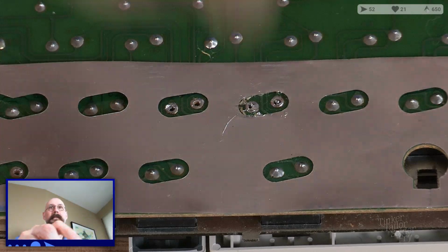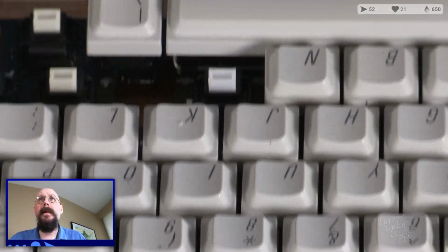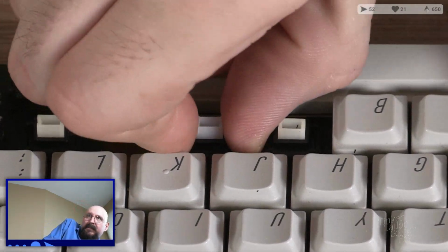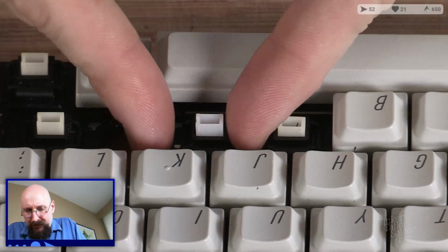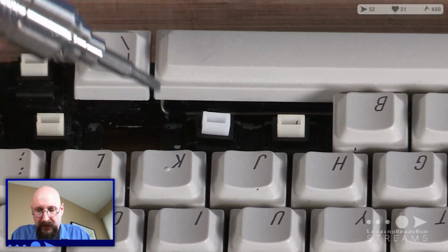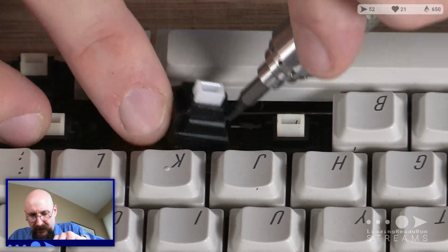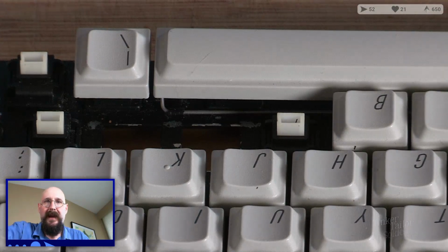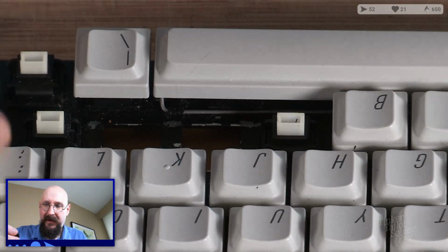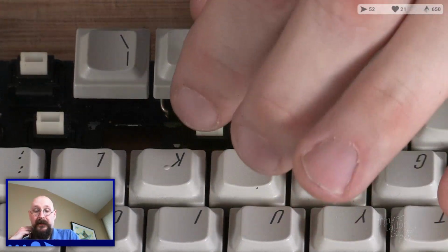Okay. Whew. Let's flip it over and just get my meaty fingers in there. Yank that off. Now, very carefully pry it up on one side and do the thing carefully on the other. And there we go. That's a switch out. So that is a bad switch. That's known bad. I'm putting that in the known bad position. Let's solder in some known good switches here. Let's replace that with a known, or at least a new purchased.